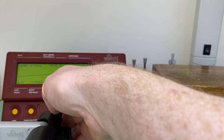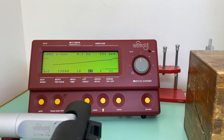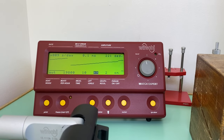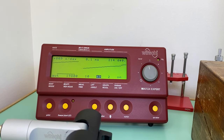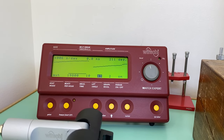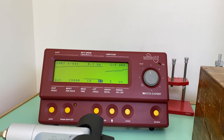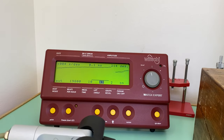Let's check our crown down positions. We're always going to have a lower amplitude in crown down positions due to more friction on the pivots of the train wheels, so it won't perform as well. We have a low amplitude of 210 in that position, which is a bit low — so amplitude is something we definitely want to address. Timing is certainly not terrible for a watch of this age, but we'll see what we can do there too.